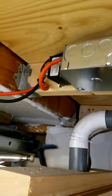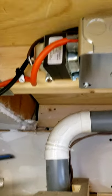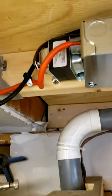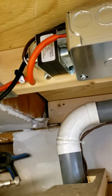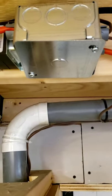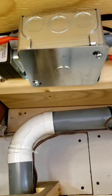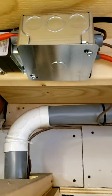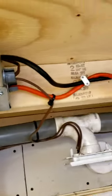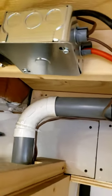I have a box up here. On this side it has the 24-volt rectifier — basically it takes 120 volt AC and brings it down to 24 volts, and that voltage is used for the actual central vac switch. Then in here are the power connections, and I also have a relay. What the relay does is when the 24 volts makes the connection, the relay connects to 120 volts. This power coming out is where I have the vacuum plugged in, and that's what the relay controls.